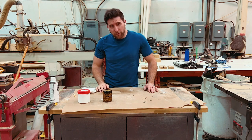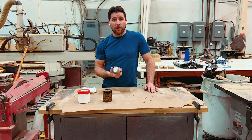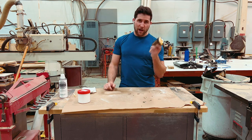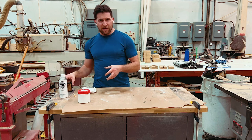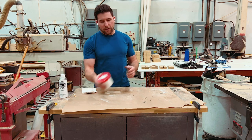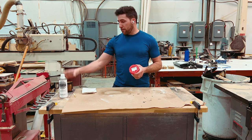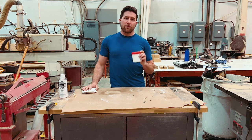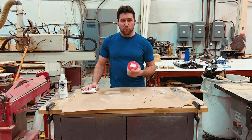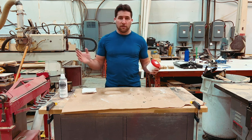So there we have it — three ways to get a smooth satin finish. First, simply apply a satin clear coat: build up with a gloss clear for a high-quality finish, then finish off with satin. Second, use something like a hard wax oil — ODS, Maximum Guitar Works, modified tung oil, or shellac — which you can buff up to a satin finish. Third, take a clear coat that's already gloss and buff it back to a satin, using a hard wax oil or a more aggressive compound designed to knock off gloss. You can also sand a gloss clear coat with orange peel smooth first, then apply satin through one of these alternatives.